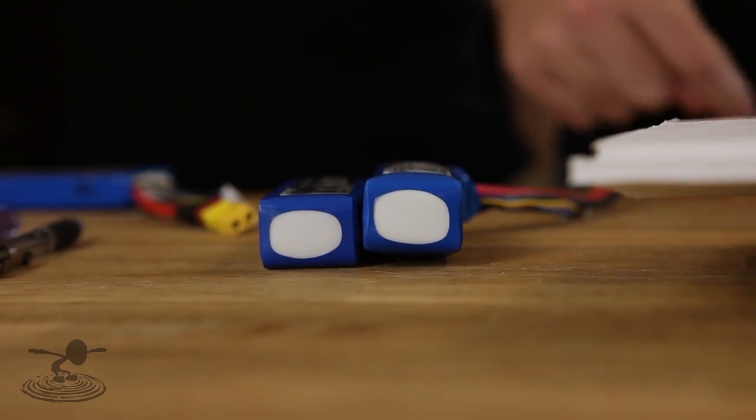You shouldn't be able to tell that they're warm. When things are hot, things happen quicker. The most critical point in a battery's life is when you charge it, because you're reversing the flow of electrons — you're pushing it into a state it does not want to be. So when the battery is warm, the process will accept it quicker and that's not good.